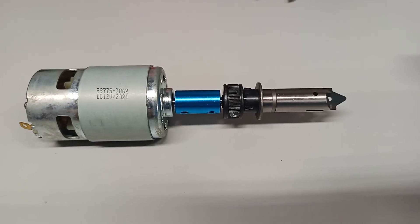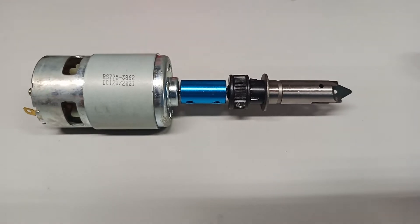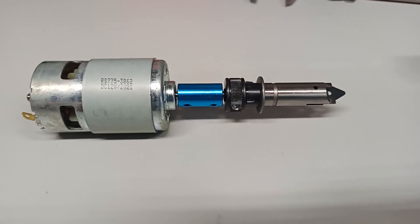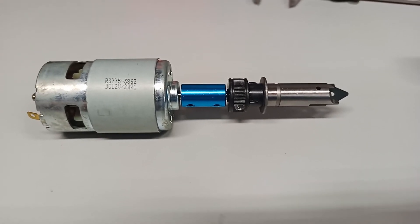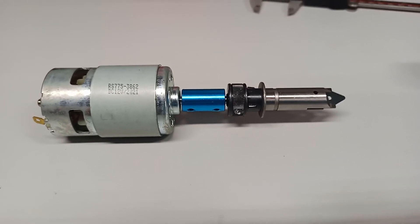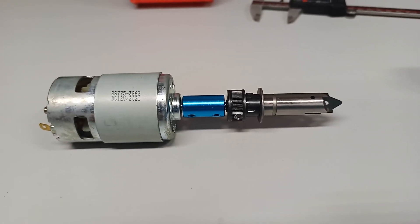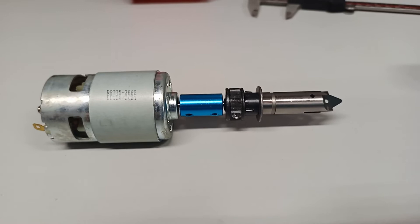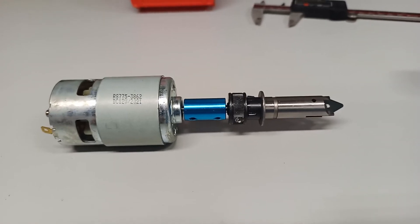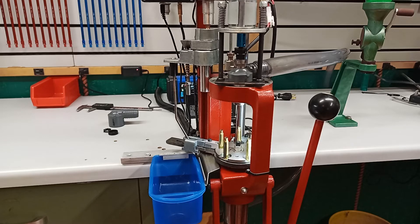This is what the motor shaft system looks like without the heavy washer — what I call the anti-torque flywheel. That big heavy washer serves two purposes: it gives a good mounting surface, and because it's heavy, it acts like an anti-torque flywheel, keeping everything from jumping around when the motor turns on and off. It works really well. If I had used something lighter there, I think I would have had trouble with it wanting to stress the bolts repeatedly.